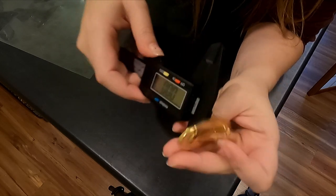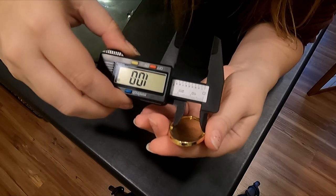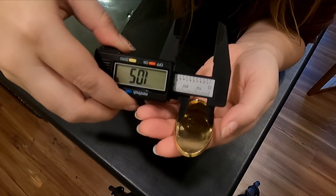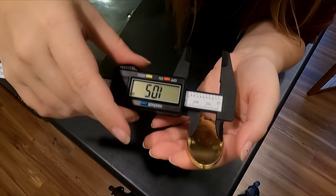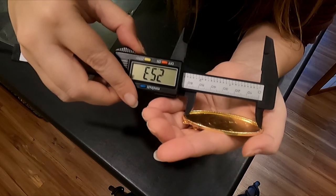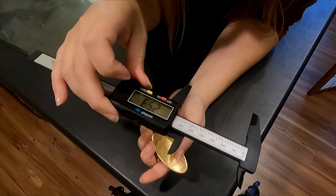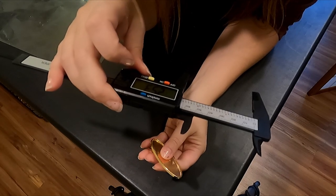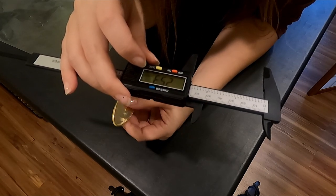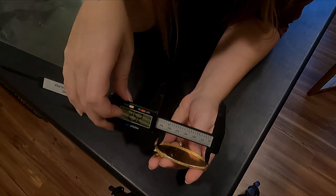So you're going to pull them apart and get just inside of that lip. I'm going to line it up with some lines that are in the barrette — we're looking at 1.05 inches this way, and then the other direction we're looking at 2.53. This is going to be way more accurate than anything I'd do with a ruler, because it's already in decimal form and it's going to sit right inside that lip perfectly where a ruler may not.